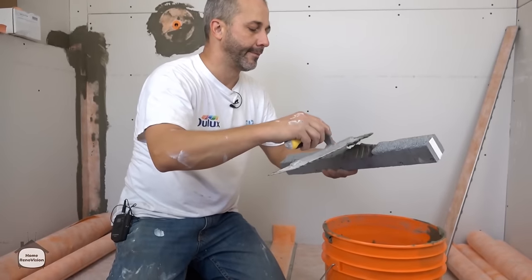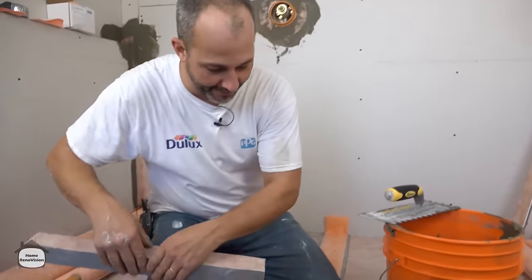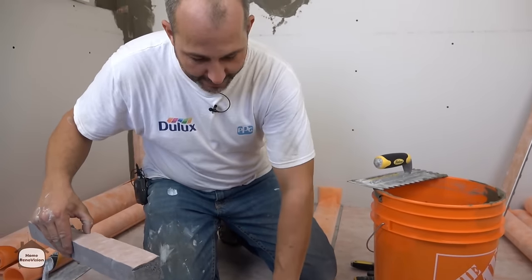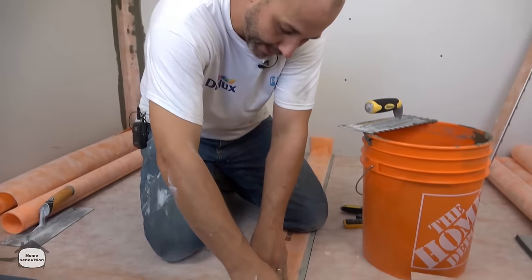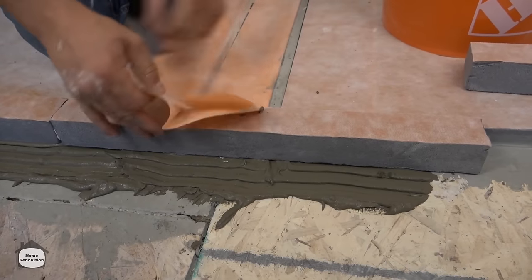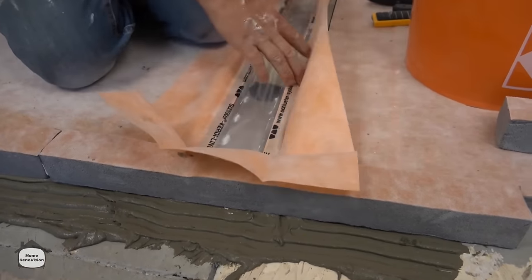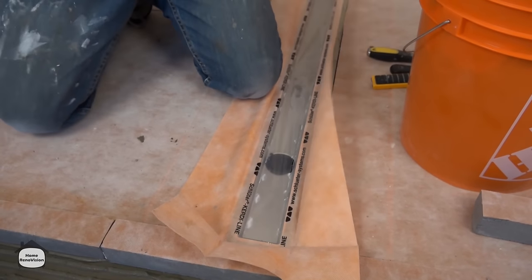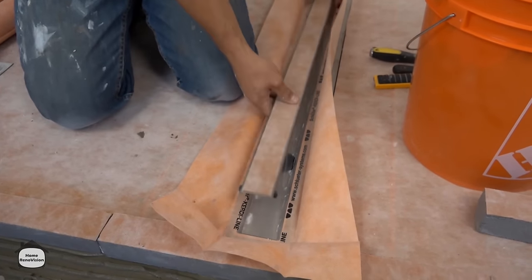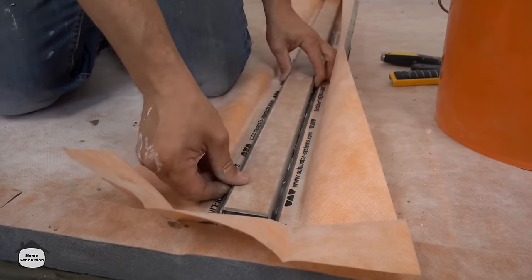Now here, it's just a design situation, so I have my shower drain, my linear drain, it's extending a little bit past my floor pan. So I've just notched my curb. When I open this up, you'll see my finished floor, while we're talking about it, let's show that. Here's my drain. Now right now there's a plastic guard on top of this, but this will be covered in tile.